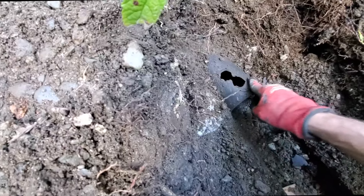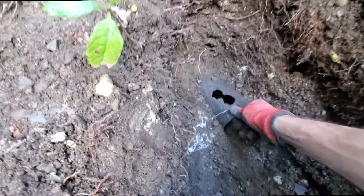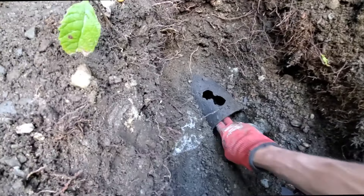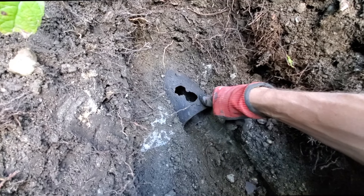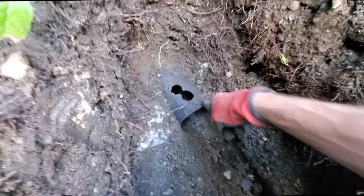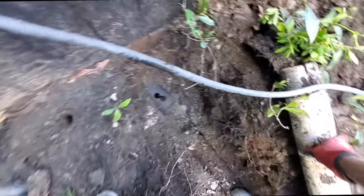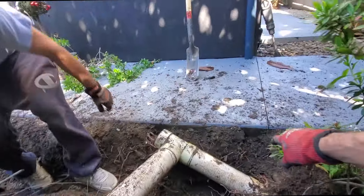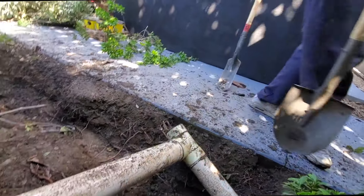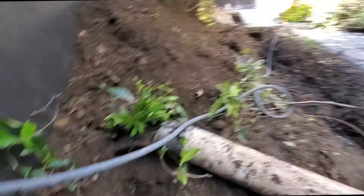There's no roots in here. Really? Yeah. I'll camera it, but that looks like it might be orangeberg. Might not even have to go all the way, just tie it in right here. Yeah, very possibly. Camera that and see. We definitely got to replace this 90 and this whole section because it's just chock full of roots.